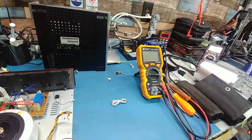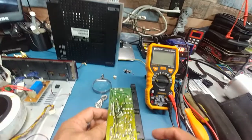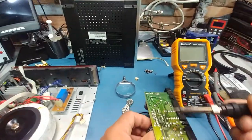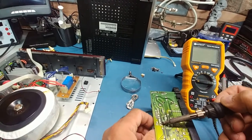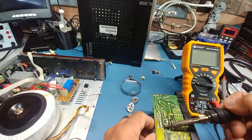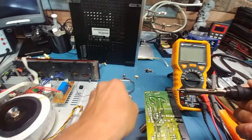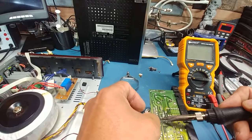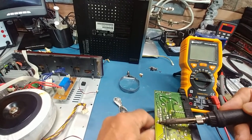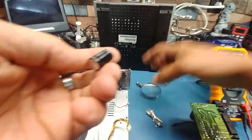There's a legend on the board so when I pull the cap off I know the polarity. I'm going to try and find the biggest replacement cap I can - the bigger the cap the better. This one is old - 25 volts at 2200 uF. I don't know if I have one or not, but I think I can do it.